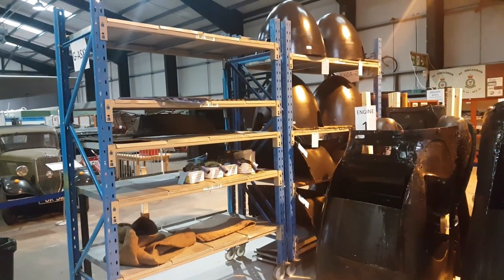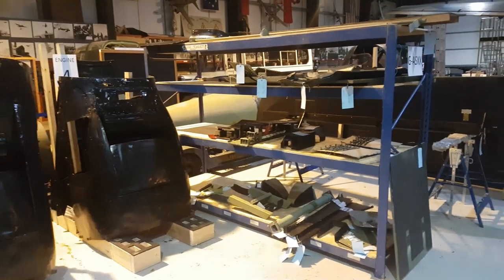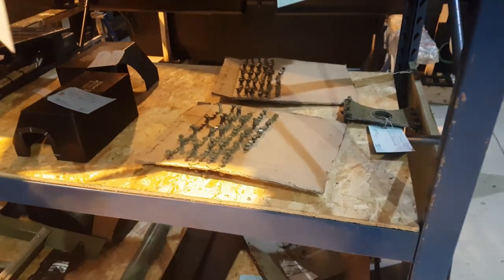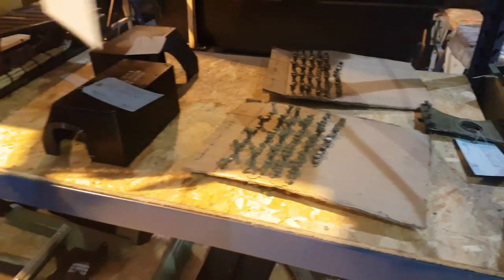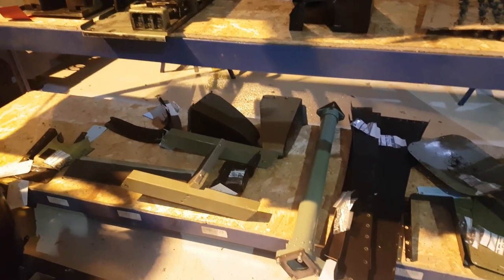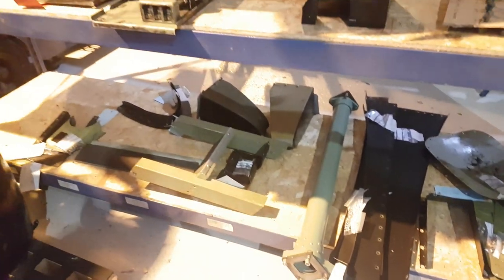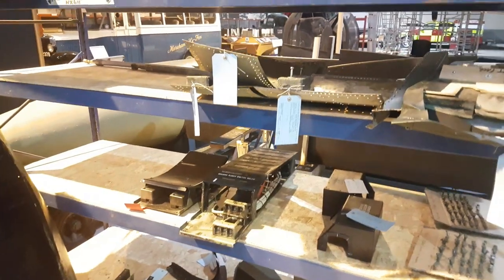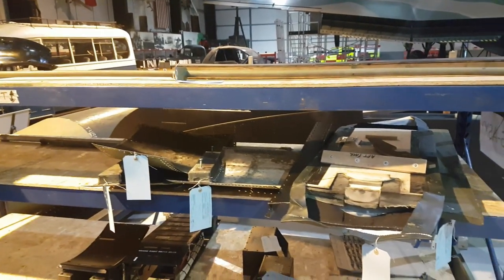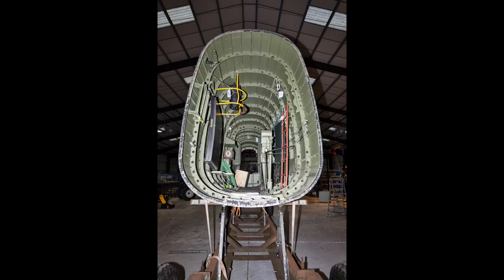All the engines have been stripped to their cowlings; they're all sat here, each engine individually, with all the spinners on the racking as well. On this rack here we have some of the parts taken out of the fuselage to enable the fuselage split — you'll see all the nuts and bolts from the transport joint, and on the right-hand side the small plate that holds the top of the tail oleo in place, some electrical covers, the large bar that attaches port to starboard elevator, the fillet panels, the step up on top of the H2S blister, some of the other tailplane fillet panels, and one of the handhold bars that runs through the fuselage.